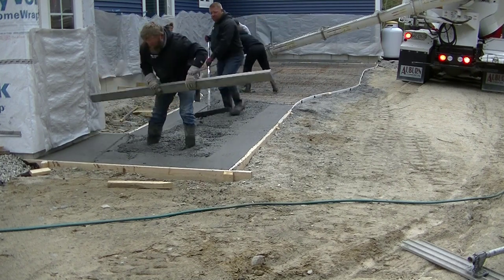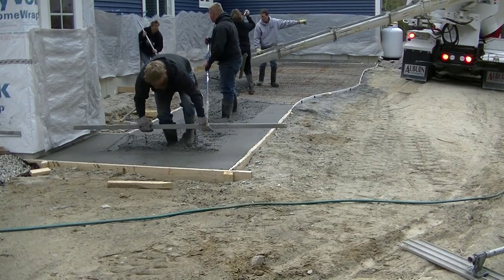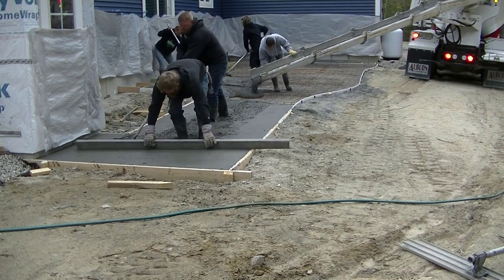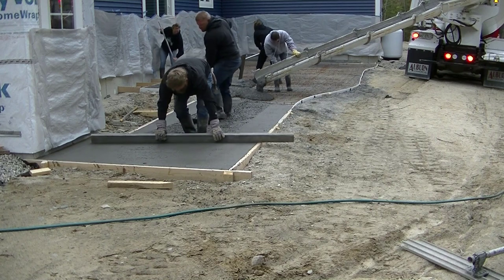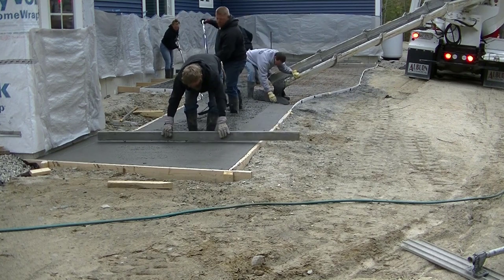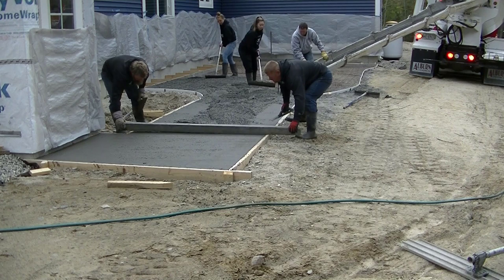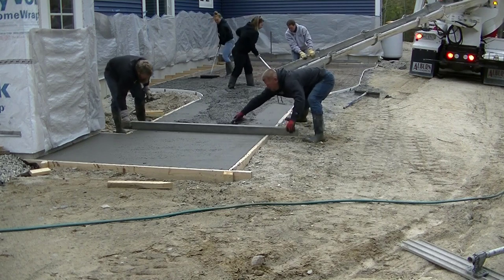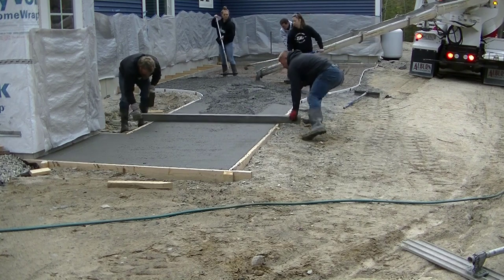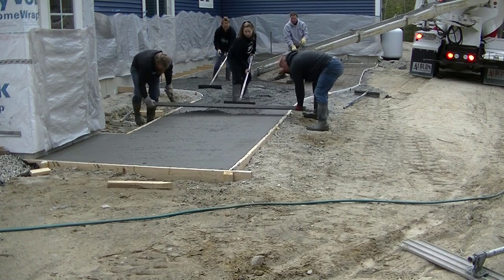This was about 8 yards. We like to get something like this all placed and bull floated in about 30 minutes. A lot of guys will do it faster. Some of you will be slower based on your experience. But if you can get it down in a relatively quick amount of time, then you don't have to worry so much about the outside temperatures setting up the concrete too fast. Now today is kind of cloudy and it's not super hot out. As you can tell, we got sweatshirts on, so we're not real worried about it setting up too fast,